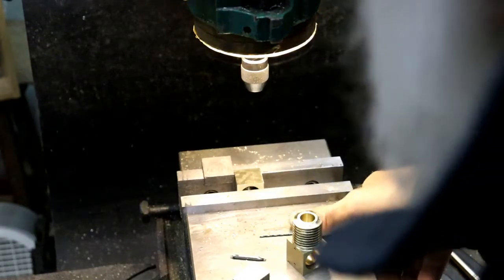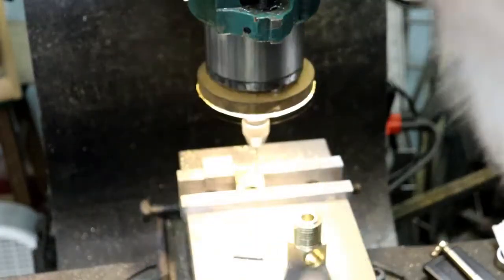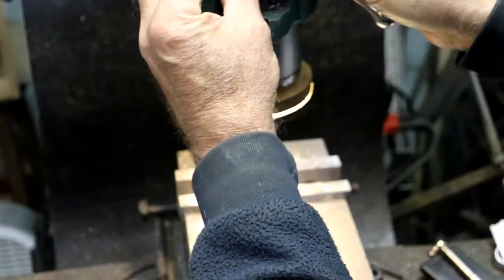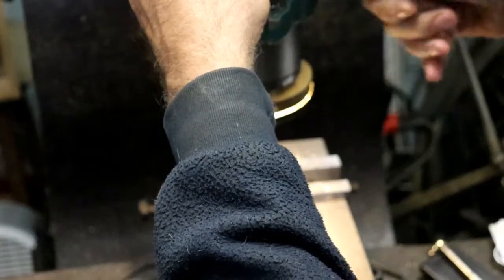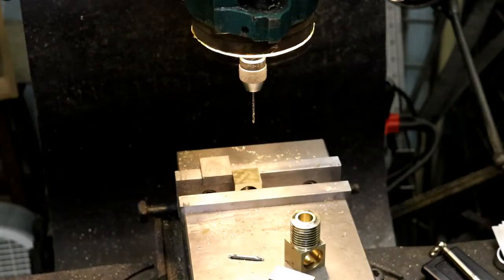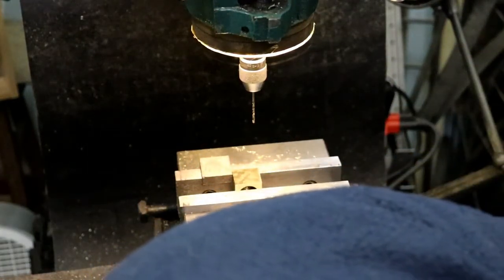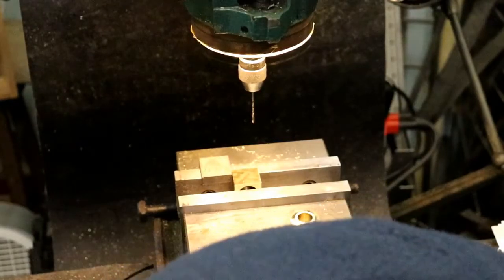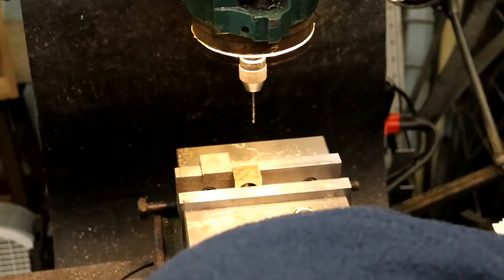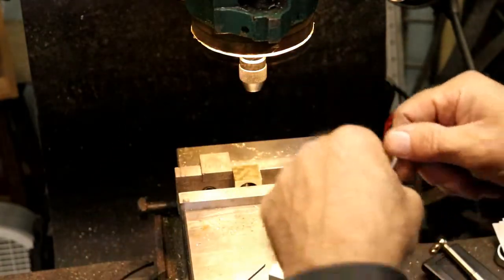All right. And now we need to set our drill depth again. So let's put the drill all the way up in the drill chuck. In here, we're going to come down, touch lock it, and bring it up against the block, the spacer block that I've got. Bring it up against that tight, and then on this side, no, I can't go over 200 deep. I'm going to go 175. So I need to zero my knee. And we'll go up 100, 50, 60, 75. All right, let's give her a whirl here and see what we get.